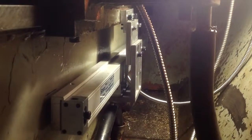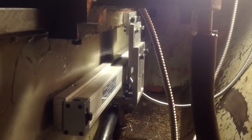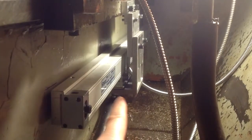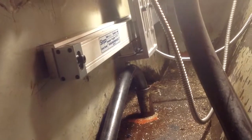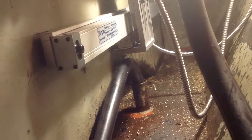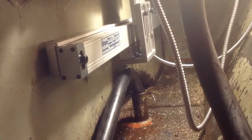There were enough bits of slidey slotted angle plate in the kit to mount the read head to the back of the saddle at the top. All these bits bolted together and the read head is actually under the scale. You can just see it. There's a slightly angled shim between the head and the plate to get it really straight, because there's nothing that lines up with anything else on the back of this machine — there are no true machined surfaces; they're all rough cast.